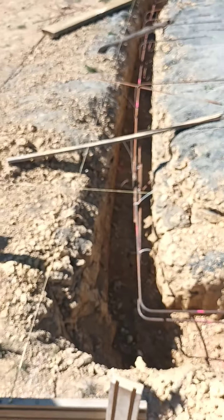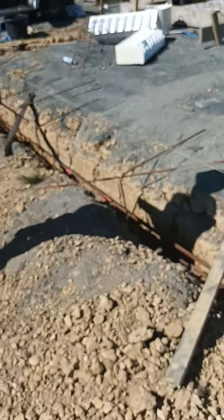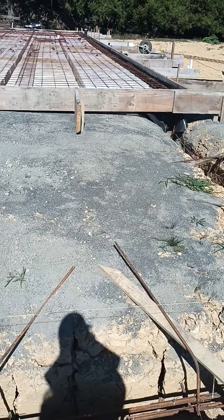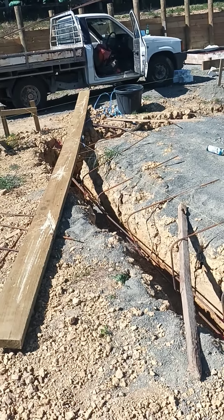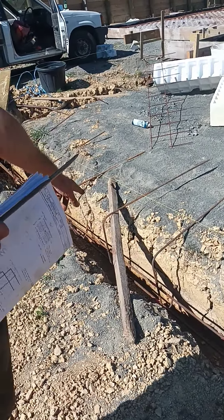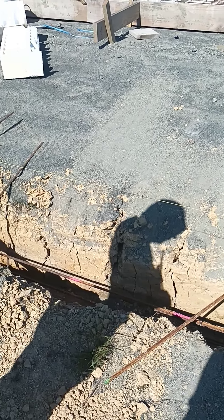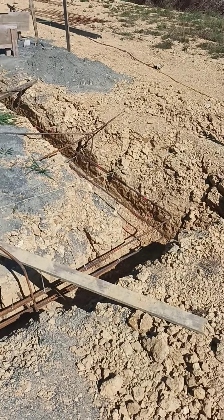You're supposed to get these starters every 600 millimeters, which we are, but we haven't got any mesh and all this needs redoing. So we're going to get this big piece of wood and sit all the starters on top so they're in the right place. That way all the reinforcing is in the right place and we can just dump concrete on it without any worry — everything's in and we can deal with everything on top afterwards.